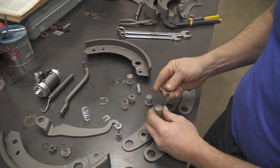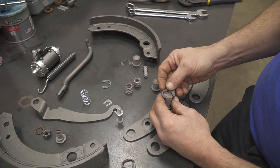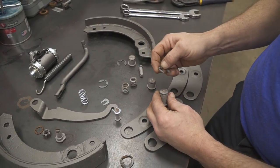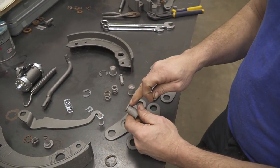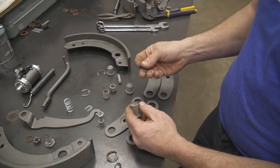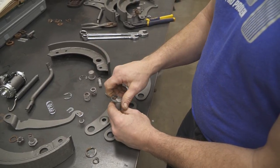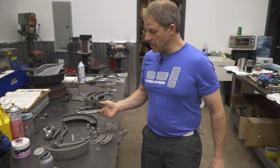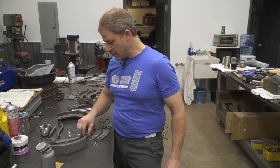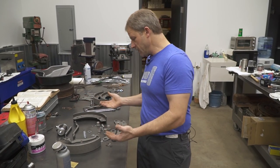When I got to the bigger pin, the issue I had was finding a C-clip that would go on there that was the right size. Ironically this is all English or standard dimensions — meaning either three-quarter or five-eighths — but it was actually neither. A number five or 15-millimeter E-clip fits the best. My point to all this is: think outside the box. Sometimes you need to be a little more creative. If the catalog doesn't show your part, understand what the function is and figure out a way to get around it.